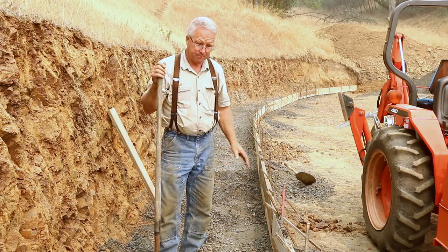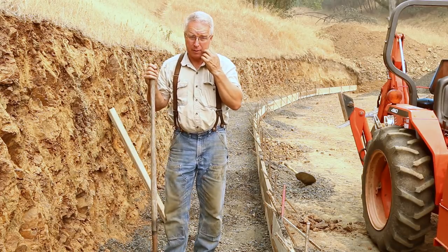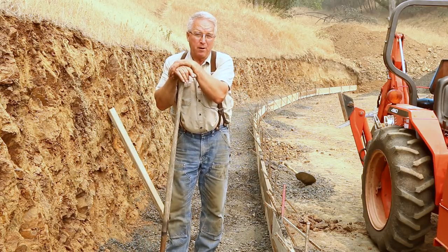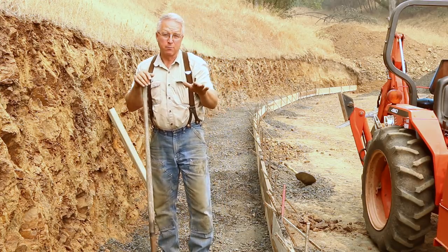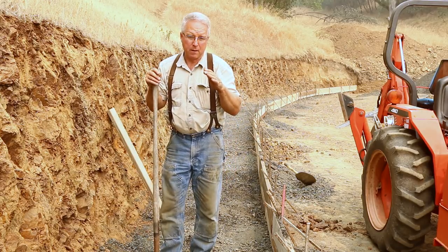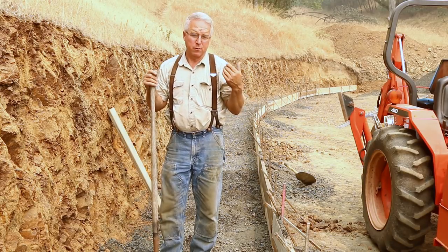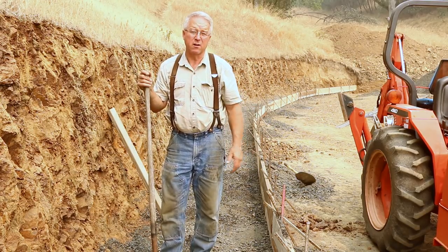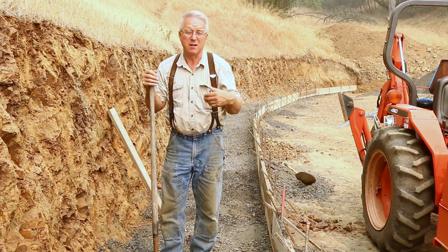And then the third piece is, when you're pouring concrete, moisture is going out of the top, especially on a slab. Now, it's not such a big deal on a footing that's 12 inches thick and 4 feet wide and nobody's going to see. But part of your calculation about how to understand the timing on your finish and get the right finish you want is how fast the moisture is going out of the bottom of the slab. If you place concrete on substrate that is not uniform, in other words, some of it would be dry clay, some of it would be dry or wet gravel, or maybe you're pouring on visqueen and no moisture can go out, that all changes the length of time that the moisture is in the mix